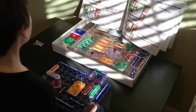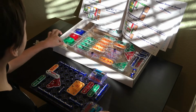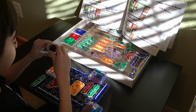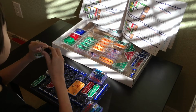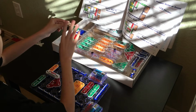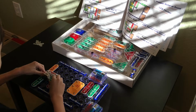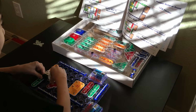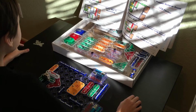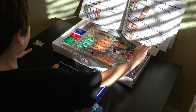Now, we're going to have the adjustable capacitor, which is how we're going to tune this radio. And it is right here. A little bit chipped, actually. It's interesting. All right. Well, that's going to be going backwards, actually. The orientation is very important. It needs to be like this, not like that. And that's going to go between this here capacitor and the high-frequency IC. Like that.